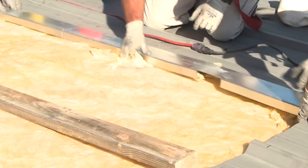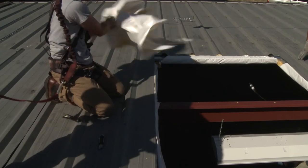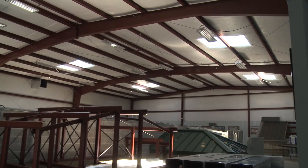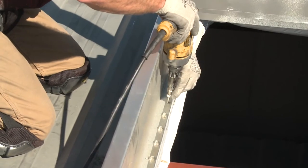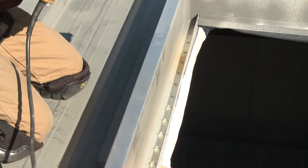The elimination of the secondary framing between the purlin or joist members results in significant savings not only in material, but also in engineering, detailing costs, and erection labor. Pre-punched holes are provided around the perimeter of the curb to take the guesswork out of curb fastener spacing, assuring optimum weather tightness. Internal fastening along the roof curb sides limits the number of fasteners exposed to the elements.